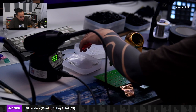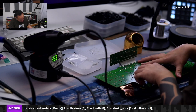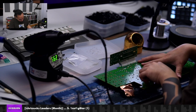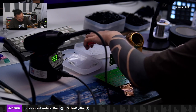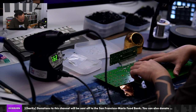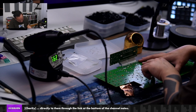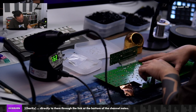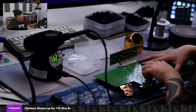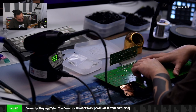So what am I looking at here? This is a Compaq MX11800 PCB for which I'm re-soldering what were previously in-switch jumper wires back directly into the PCB without being inside of the switches. As I'm re-soldering them, each of these wires needs to be cut because they're really long, and they were long because they used to be inside of switches. Now that they're no longer inside of switches, there's a lot of extra.